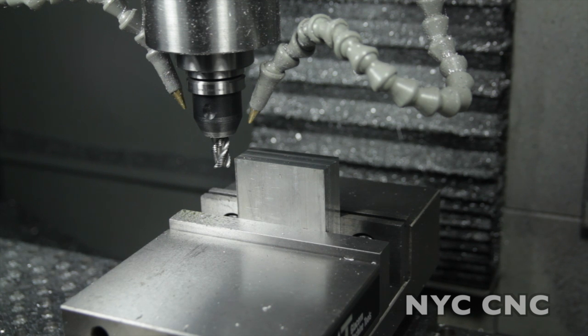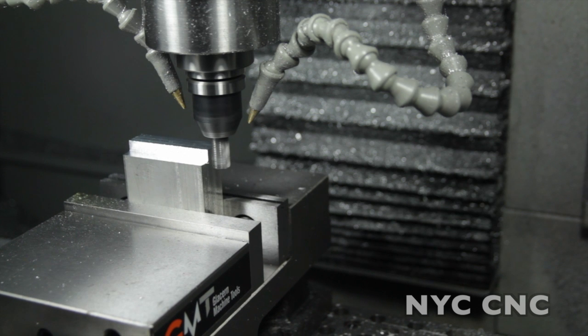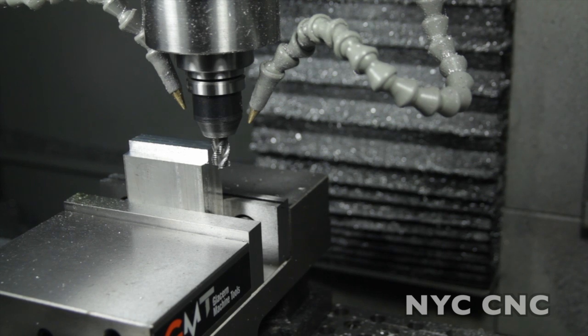Third and last cut at this depth of cut. Again, we're still at 0.3 inches. We're going to try it at 50 inches a minute. According to G Wizard, that's 1.25 horsepower, just starting to push the limit of what the Tormach can do. I wanted to mention as well, it's important that you choke up on the end mill as I'm doing here so that you minimize the tool stick out from the tool holder. You could definitely hear more strain there, but the tool is still intact and you look at the bottom surface finish of the part, it seems okay, especially for a rougher. So let's go down to a deeper depth of cut and see what we get.